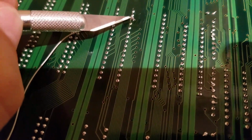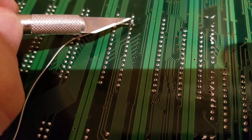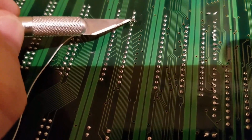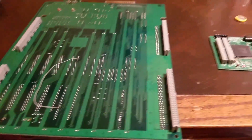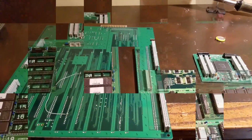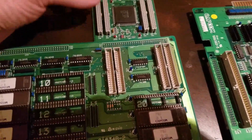new file that you have, which I believe is a 27C020. The one in there is a 010, but their website recommends you use a 020 with their file. Alright, and that's pretty much it. And now I just got to burn the ROMs, throw them in there, put it all together, and hope it works. A little recap here to Phoenix this board to bring it back to life.